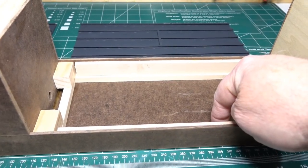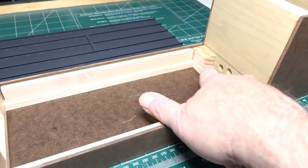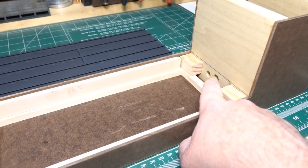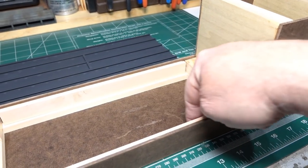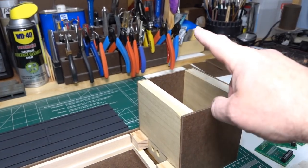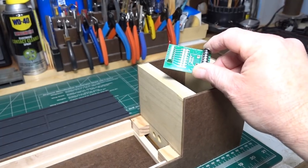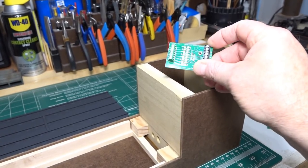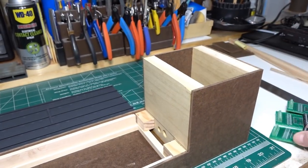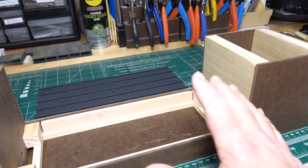Another set of 8 or 4 across here, and then bring in my 24 gauge 8C conductors into here to connect them, and then bring these out through here. Oh, sorry, a little too fast. Under the layout, and then I'll go to these mounted underneath the layout. So if I ever need to do any adjustments, it's much easier under the layout getting this board off as opposed to taking this off back to the bench and flipping it. Okay, anyway, so that's what I'm going to do.